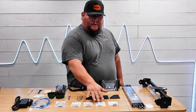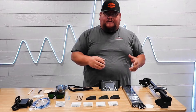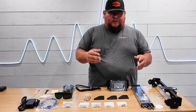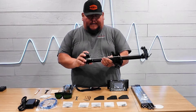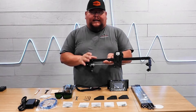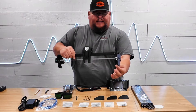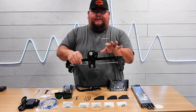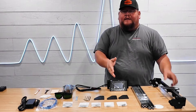All your parts are labeled accordingly for each step of the process of building this laser. We're going to start off with the frame and I'll show you step by step how to construct it and how to put the gantry on. The gantry is already assembled with the belt already in place, so that will not need to be adjusted. The only adjustment needed will be to the cam bearing wheel once you put it on the frame.